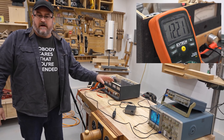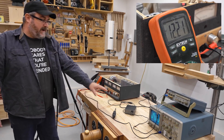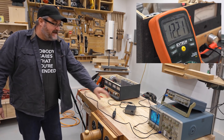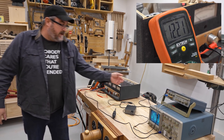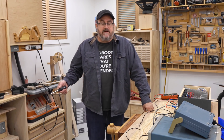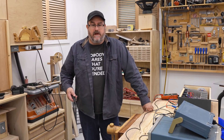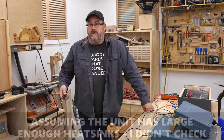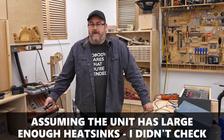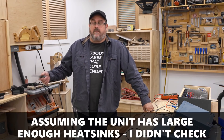It's simply not strong enough — it doesn't have enough voltage or current to deliver the power it needs. So if you really want to get 50 watts per channel from this thing, you need to get a bigger power supply. That's about what I expected. With a better power supply — a little more voltage and a lot more current — you'll get better performance. It won't clip as quickly when you crank it up.